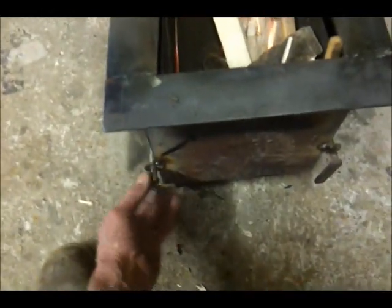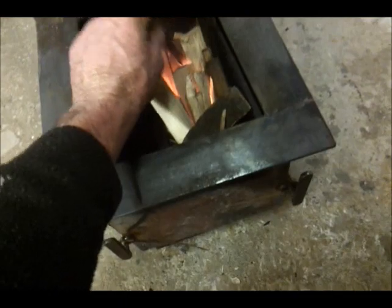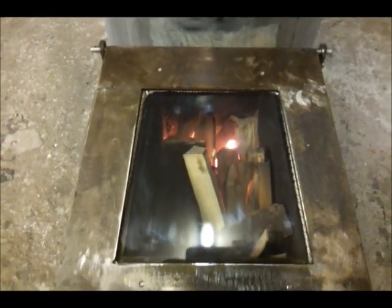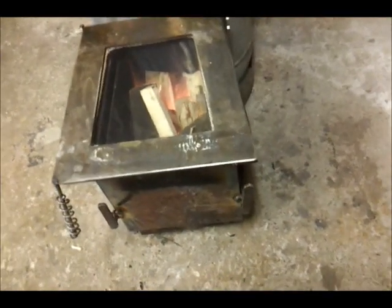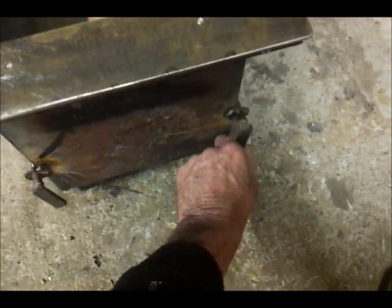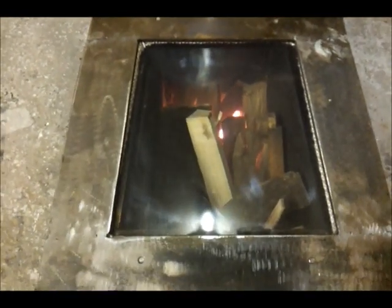What I'll do is open the side vents now to let the air in and I will shut the lid. There we are. That's why I like the lid, because I can now if I have to just walk away and leave the stove as it is and it's quite safe — no sparks jumping out and the fire is contained within the stove. If I just turn them plates down to virtually about an eighth of an inch gap, it really slows the stove down, as you can see. So the stove is now just simmering away. Open them up again and it starts burning again.